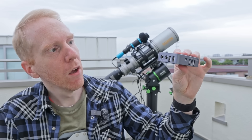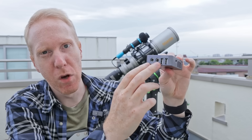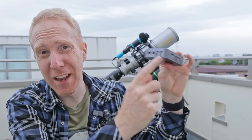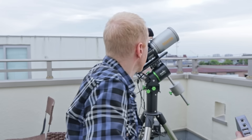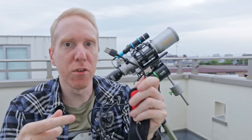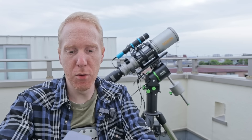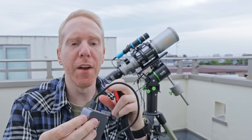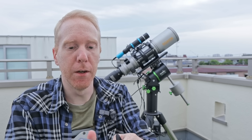On the other side there are two more DC outputs, so the total DC outputs deliver 12 volt 10 amps, which is more than enough for pretty much any rig. You also have two USB outputs that are not for data but for 5 volt power, so you can use them with a 5 volt USB dew heater — good for smaller telescopes, guide scopes, or camera lenses. Output on those USB ports is up to 5 volt 8 amps.